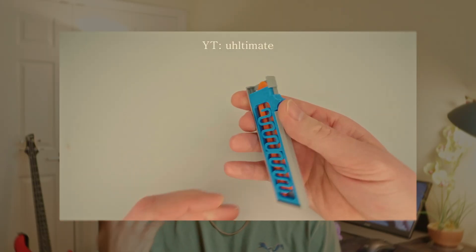With these constraints in mind, I pulled up some references, booted up SOLIDWORKS, and got to work. Referencing this model from Ultimate, my first goal was to understand how retraction mechanisms actually work — once I did, I could integrate it into any design. The OTF mechanism could be broken down into three main parts: the casing, the blade, and the spring.